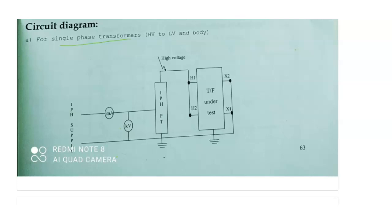According to the rating, if it is 11 KV we have to apply 28 KV. For 60 seconds we are applying the rated voltage. And if it passes, then this routine test is passed.